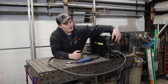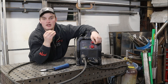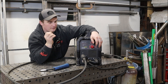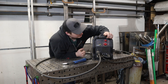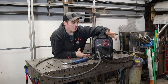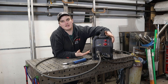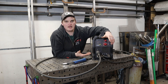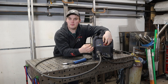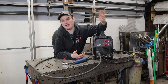The second primary change on the gen two is the readout. This gen one has a manual dial indication setup, and the new generation has a digital readout. A lot of people were complaining they wanted digital readouts. I personally don't mind this — I don't see how having a digital readout is much different from pointing to a number. My feeling is that with a lower-dollar machine you don't even know if that digital readout is necessarily accurate to the amperage it's putting out. It all comes down to using the chart on the inside of the machine to get in the ballpark for your material thickness and wire diameter, then tuning from there.